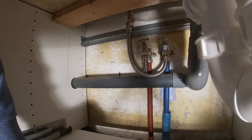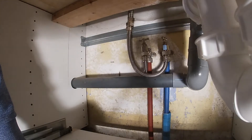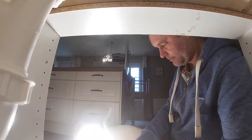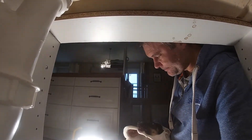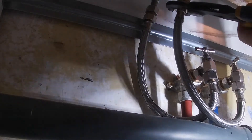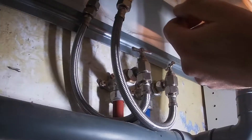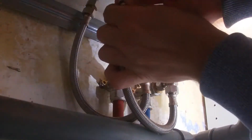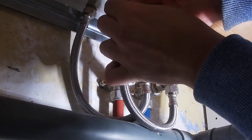And of course the pipes have all got water in. As soon as you crack the nut and let the air in, the water will come out. You're going to need a bowl because there will be some water. Any bowl will do - it won't be a lot, but just enough. Or you can just put a towel down or something like that. So once you get it to the stage where you can do it with your fingers, have your bowl ready. Just undo, and then point it straight into the bowl when you think it's undone.